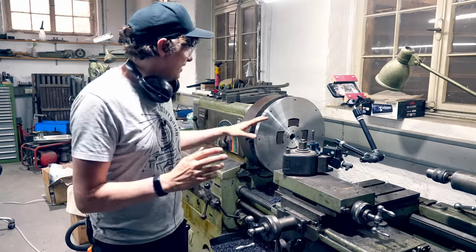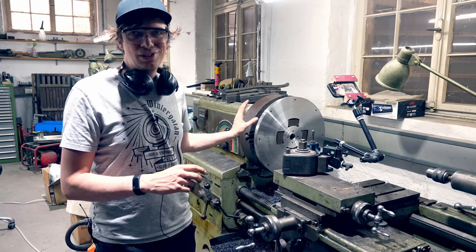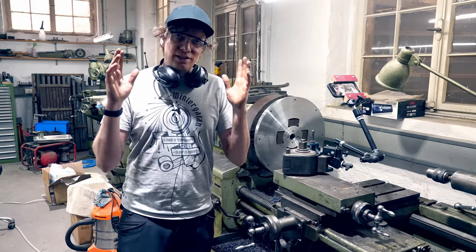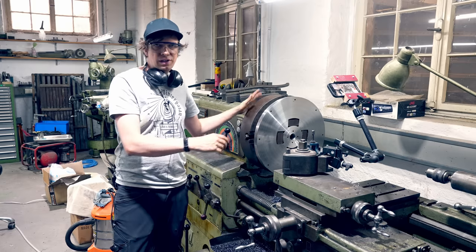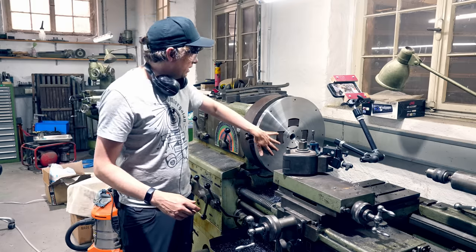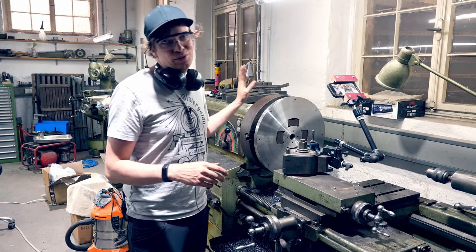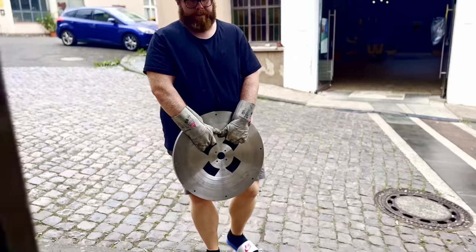That was the last cut, and oh how much I have learned. This is not really a beginner project, I think, on this machine with this four-jaw chuck that hasn't been used for 10 years. In the beginning of the project I had a problem getting the tool where I wanted, but then in the other half of the project I realized that most of my problems were that the chuck and the work holding was not doing what I wanted. After I fixed that my results became better, but the bad news is I already know this is not perfect — it's going to have some wobble.